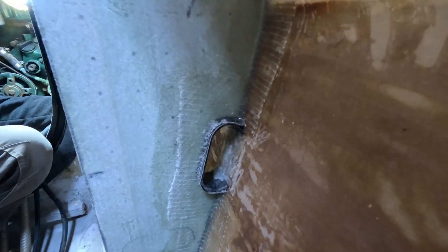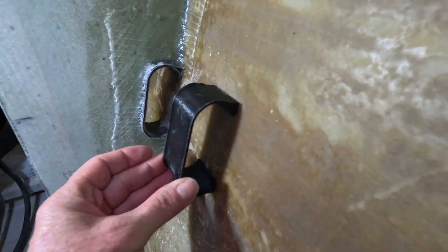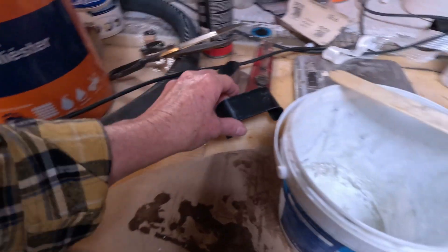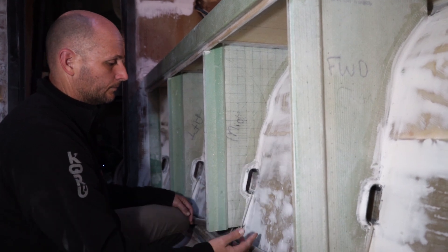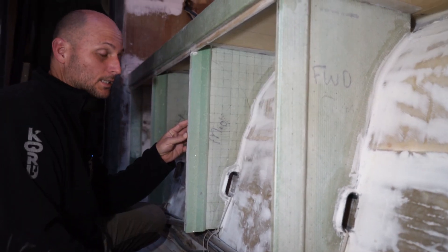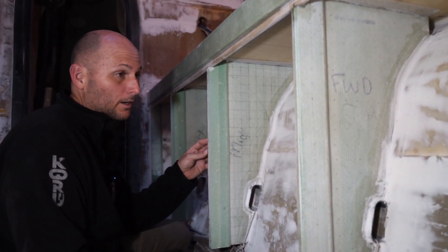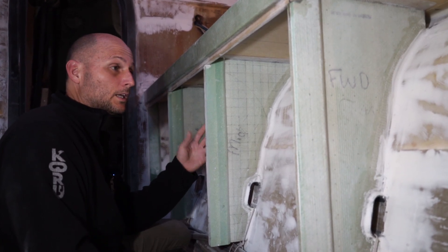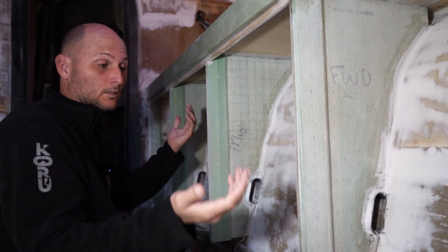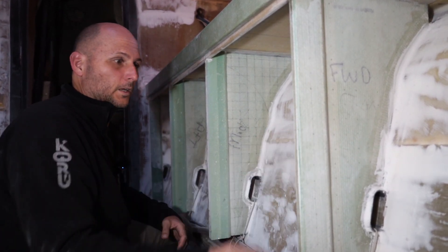So these penetrations were 3D printed - I left the 3D printed insert in here. Our hoses will actually sit on a plastic radiused edge so that there's no hard corners to wear through hoses and things like that. These are all bonded and laminated in so they're part of it now - hopefully in 30 years time they'll still be there. There's not much to say other than they're stupidly light - very lightweight skin on each side of the 10 mil foam, 300 gram. But these are for holding the bunk in place and for holding our socks and undies, so it doesn't need to be much more than that, and even then it's pretty freaking rigid.